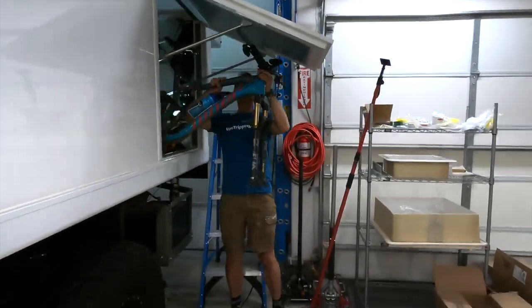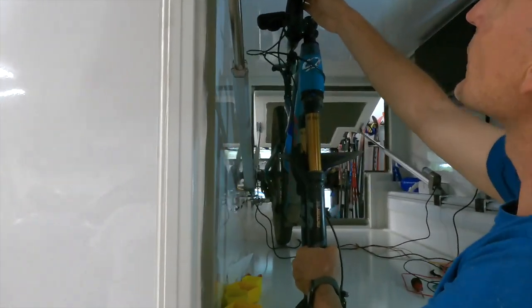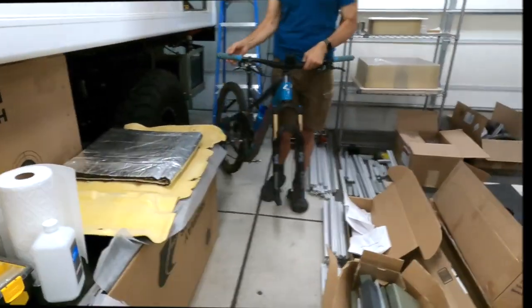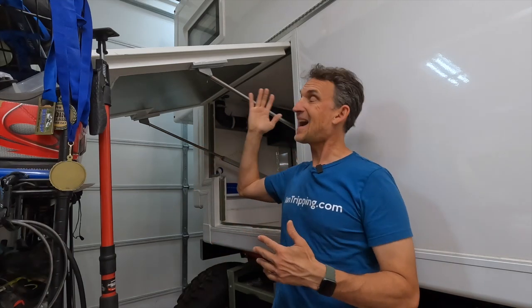Probably the most critical test is actually getting my bikes up in there. You can see from this image that the garage door is slanted lower — I eventually set it to almost 90 degrees, making it a lot easier to get bikes in and out of the garage. These are working — it's a super exciting day. The tracks for adjustability on the inside and outside are each adjustable in two different planes, so I can adjust both height and length.